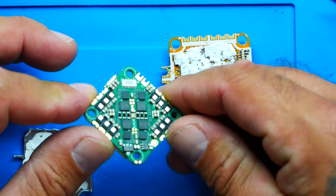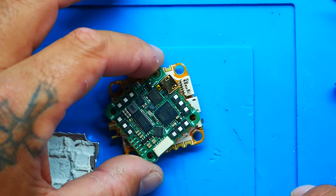This board is coming in at $130 — that is a very hefty price tag. We are looking at a worldwide chip shortage and things are going up. Right now you can get the Beast H7 — that's an H7 microcontroller — or you can get it in an F7. Although it's a whoop-size board, it's the same idea: 45 amps, F7 microprocessor, ESC, flight controller, PDB — everything all in one for $70 versus $130. That's nearly double the price.